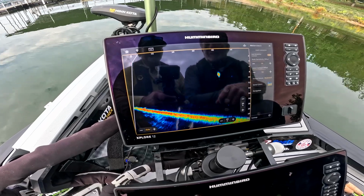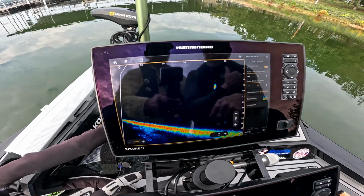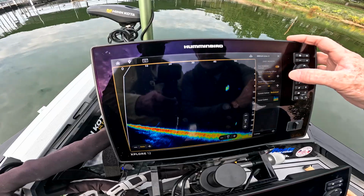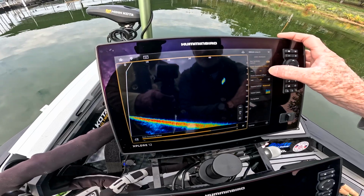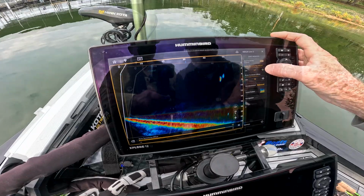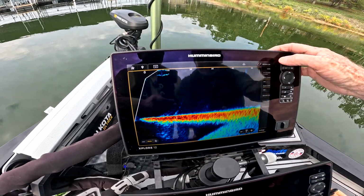We can compensate for that a little bit, because we have an offset for sensitivity and contrast in the auto mode. So you can set it up how you personally like it in the water that you're on. I'm going to bring sensitivity up a little bit more, so I just start to see some of those smaller returns around the outside right there. Once we've done that, close her back out.